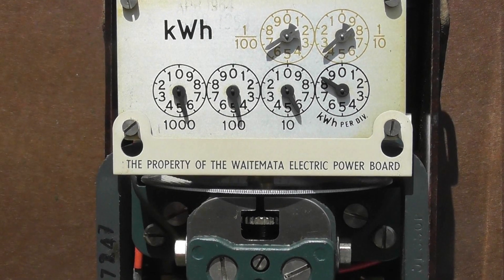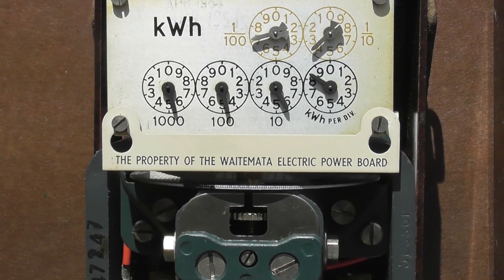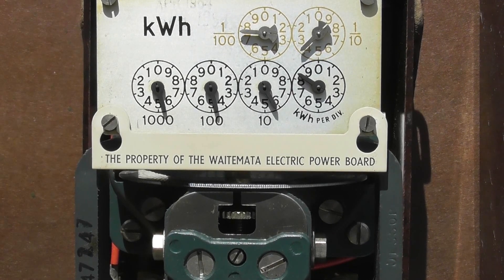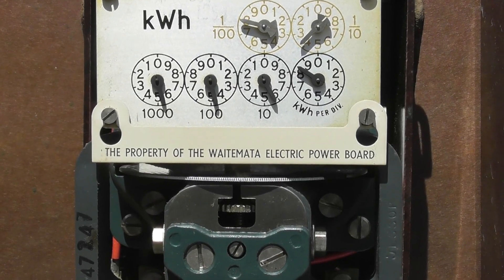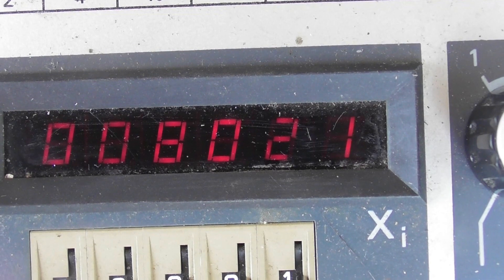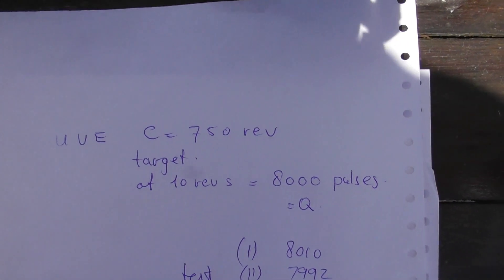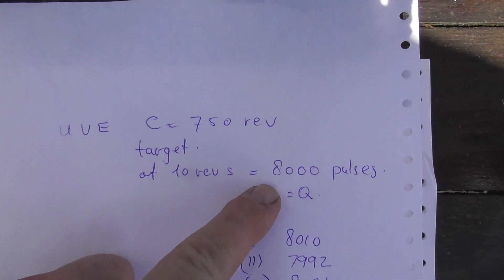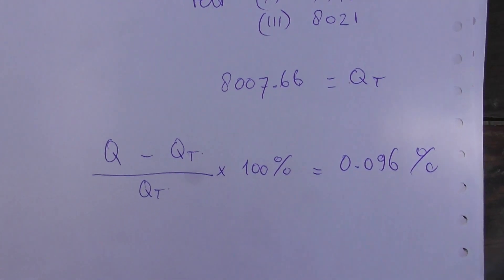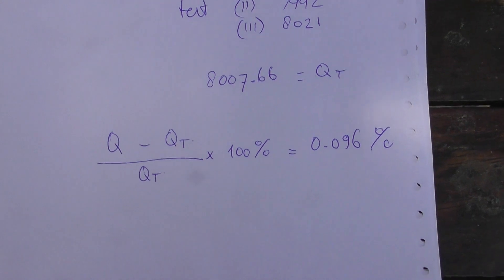Measurement number three is the push button. Start. One, two, three, four, five, six, seven, eight, nine, ten. And at 8,021 — surprisingly good results for that meter. That accuracy was exceeding my expectations for the UVE. The constant is 750 revs; ten revolutions on the standard is 8,000 pulses. Standard is 600,000 pulses per kilowatt hour. Three tests, average 8,007 pulses. Simple calculations: less than 0.1% — that's actually flipping amazing. Negative, so it's going a tiny bit slower.